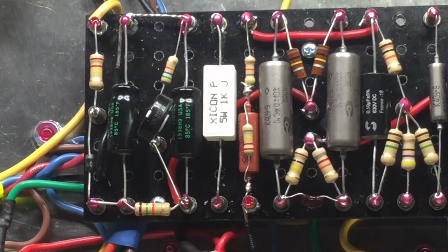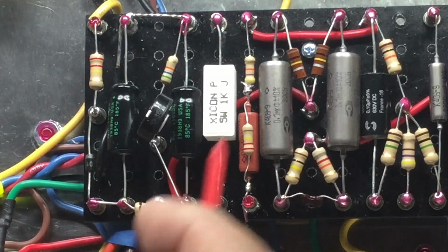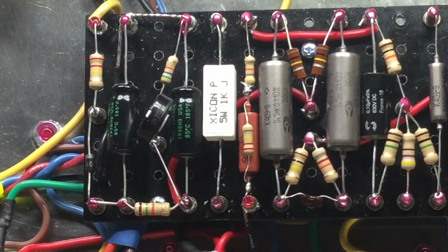So normally what a technician should be doing is placing his positive lead from his digital voltmeter in this location or this location, and then of course his common will go to ground. And you're looking for somewhere between negative 38 volts to negative 48 volts. If you look at the schematic, design engineers have already predetermined the proper voltage. For an example, on this particular JTM45, design engineers have stated that negative 46 volts is the proper voltage.